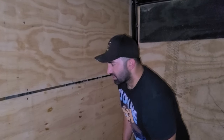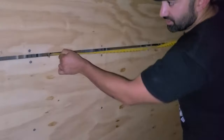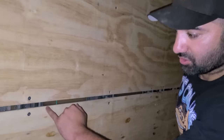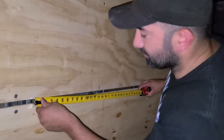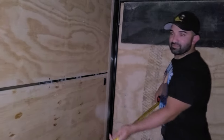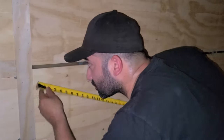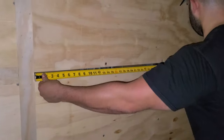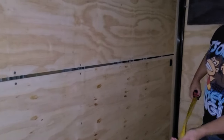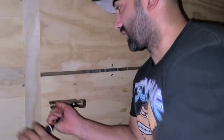The concession window I currently have is 78 inches. I'm going to measure from right here — they call this a rough opening, which is the full hole size. Going from one stud I get 61 and a half inches, which is smaller than what I currently have. Finding the next stud over, I get 77 and a half inches. There's a stud right in there where these two points meet.